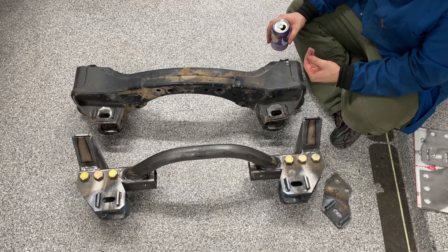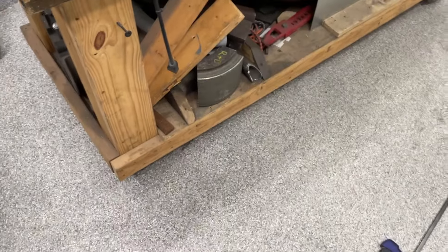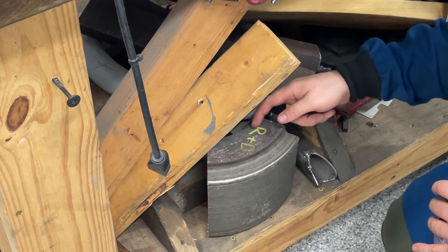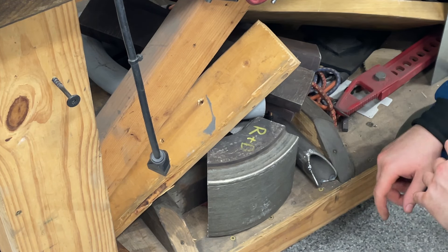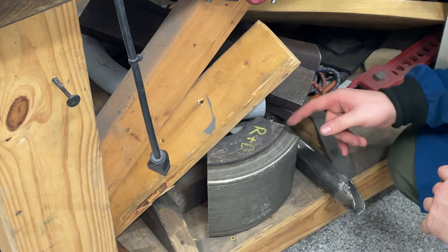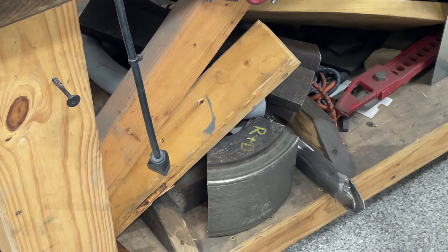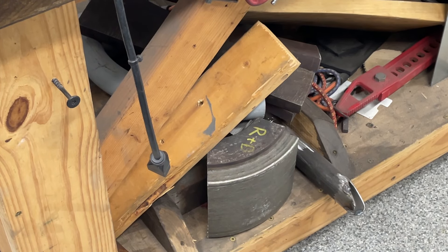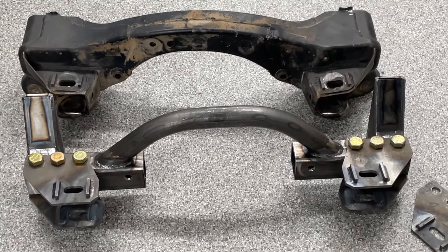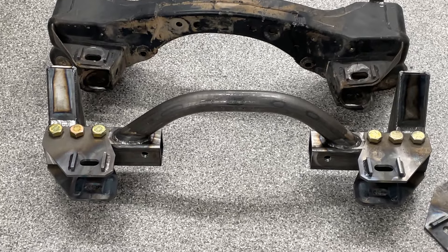In my world as a welding engineer and the kind of stuff we weld on — this material you see over here is also 4130, the same alloy as those little plates you saw, except now it's very thick and the weld is also very thick on top of it. This is Inconel on 4130, to be exact. You can see the stark difference in thicknesses. We actually preheat it to 600 degrees Fahrenheit and weld it around 700 degrees most of the time, so we don't have a hard heat affected zone when we're done. That still requires a post-weld heat treatment or a stress relief afterwards. Material in this size territory yin-and-yangs between needing a high preheat or a post-weld heat treat — or stress relief, as some fabricators would call it.